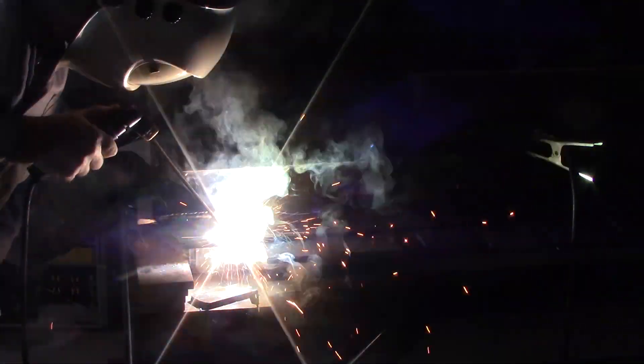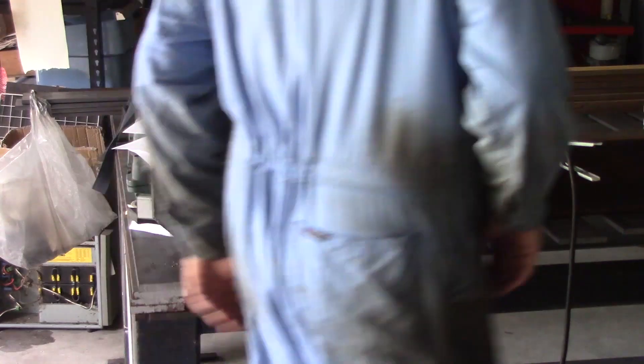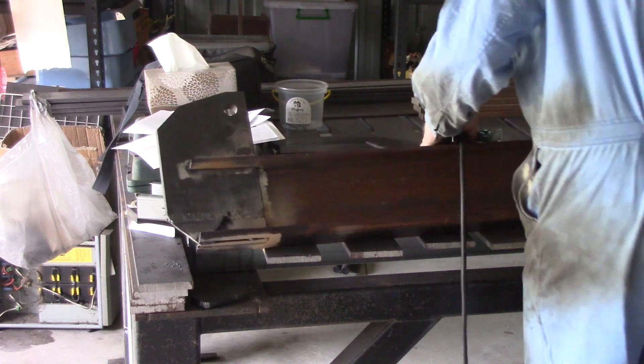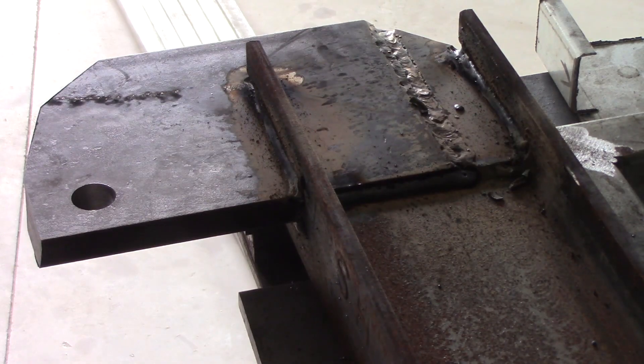I'm getting good at using these rods right up. Need a couple more passes across those. I've got to spin it around and go from the underside as well, and weld up and down in there — which I forgot to prep on the horn, but never mind, it's too late to worry about it now. Good penetration from the other side; I'm going to run a bead along this side now. I'm going to let that cool a little bit and get a wire wheel on to get the flux off. All those ones I put on will get at least one or two more passes, and all the areas I haven't done yet. Given the load that's going to be on these, probably three-pass welds on just about everything; these front welds might only need two passes — I'll see how they go.